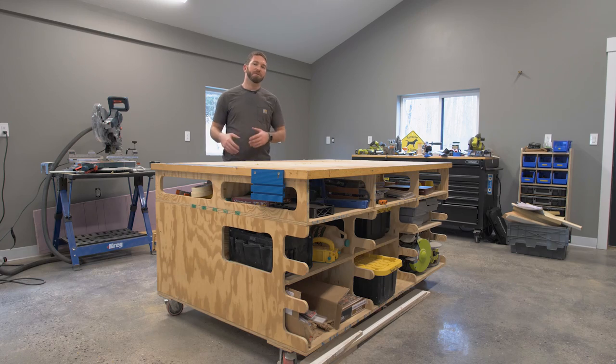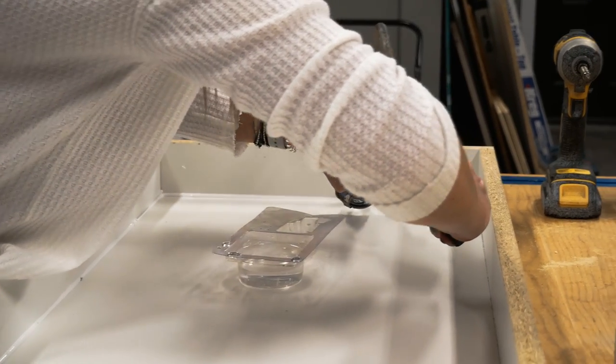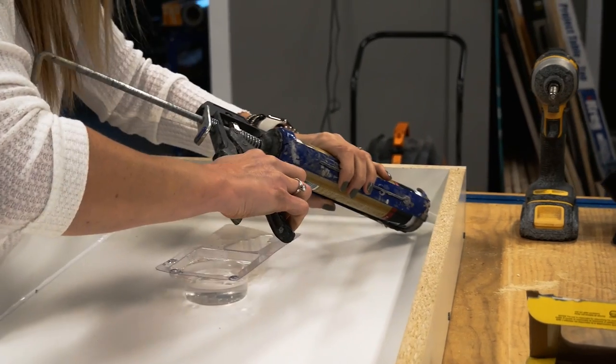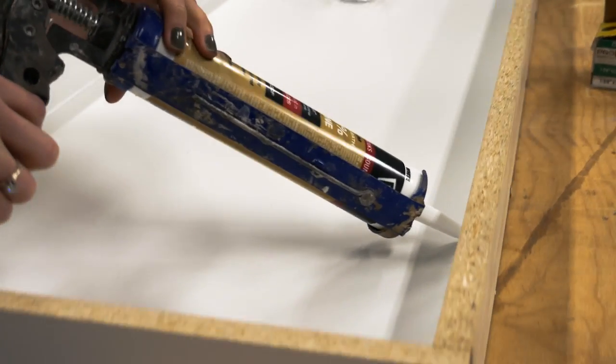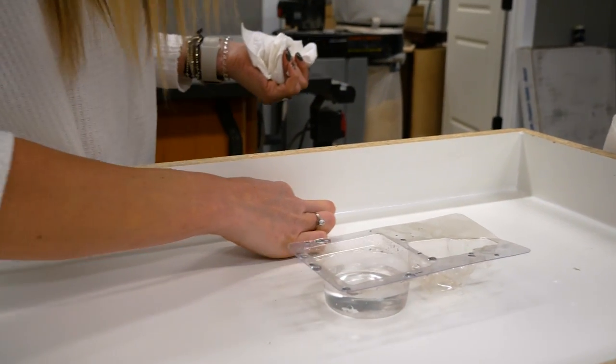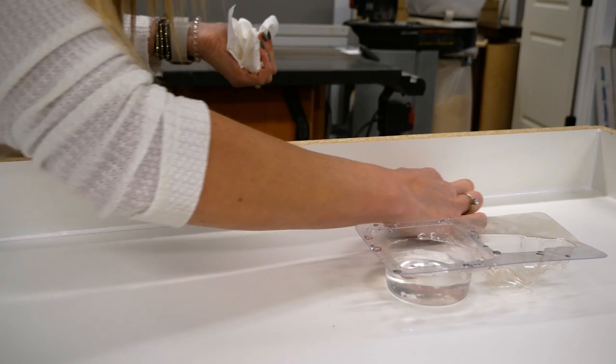After you get the form all screwed together, then you can apply a bead of silicone to the inside seams. Now this is one of those things where it's going to give you that mitered round over edge to the concrete, since the face of it is gonna be down. You're gonna wanna lay that bead of silicone down each of those seams and then up the upright joints as well. And make sure that you have a cup of water on the side to dip your finger in